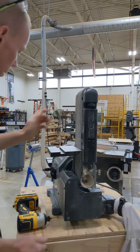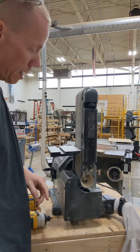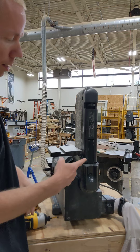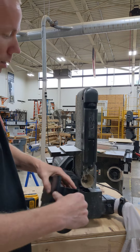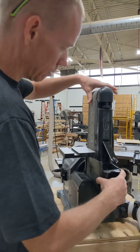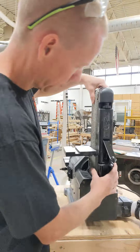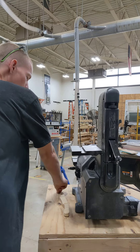Make sure it's lined up on the rollers and tighten it. Then you can place the piece of plastic back on. In this case I shouldn't have hit it down already because now it won't go on — lift that back up, then slide it back on. Put the two screws back in.